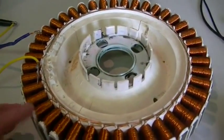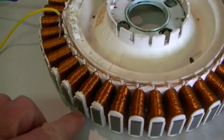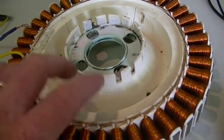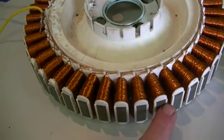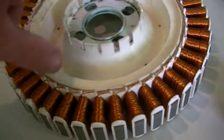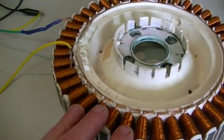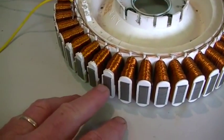So we've just got one of our stators. All three phases have been wired in parallel here, so we'll have one field shooting out from each segment of our stator. And of course the stator plates are just one full circle, so no breaks like we have on the outside. The outside field's got breaks in it. No steel magnetic path, but on the inside it is one complete steel loop with these steel fingers coming off each plate, and of course laminated plates. So what I'm going to do first is show you that the coil windings themselves are totally isolated and not shorted to the steel core.